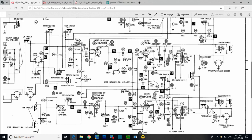This is the part I find a little confusing. Okay, so 280 volts DC supplied. I can understand the capacitor has to withstand 300 volts here, but where's the 1000 come from? Some kind of resonant thing happening here, I don't really know where the 1000 comes from that they need to worry about, but nevertheless they've obviously done it for a reason. 1000 volts. I'm going to flip the receiver over and we'll look at the same capacitors underneath and see if one of them is gooping out the same way, or what's going on with them.